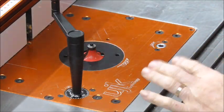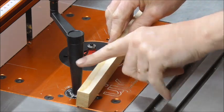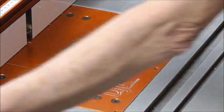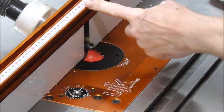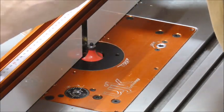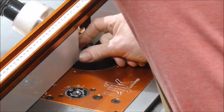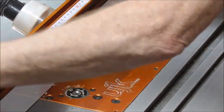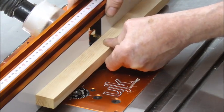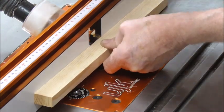The bit, being that curved shape - if you want the shank at the bottom you can have that as well, or do away with it and just have the curvature, getting just the quarter round. That is only giving us 13 and a half mil, so we're not taking the full depth but we'll round it over nicely for a good quarter round. Lock this off, then bring the fence forward. We need to keep this central, and we need to open the jaws to allow for that bit because it's a lot bigger than the last one. To neutralize the bearing, put anything flat onto the bearing and bring the fence to it just until the wheel turns, then lock it off.